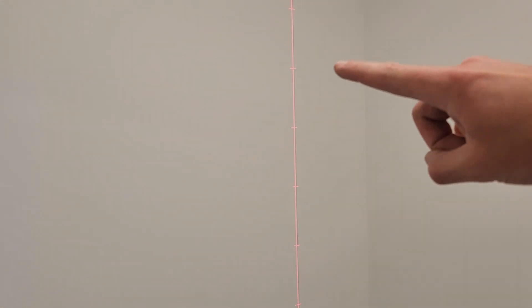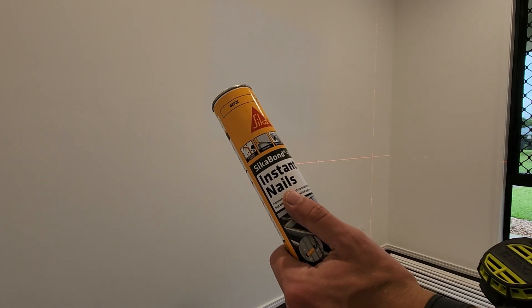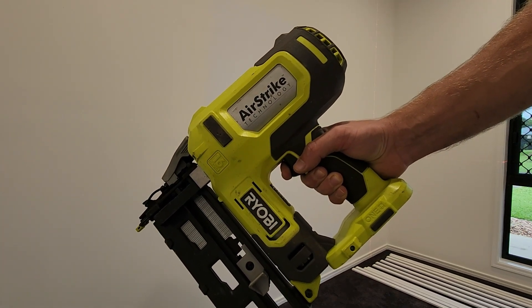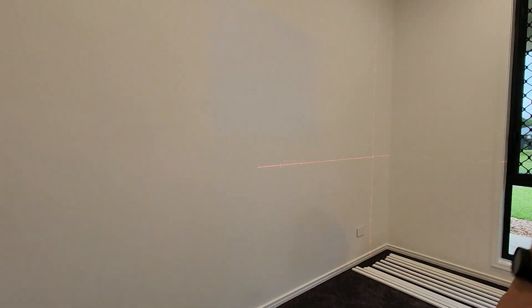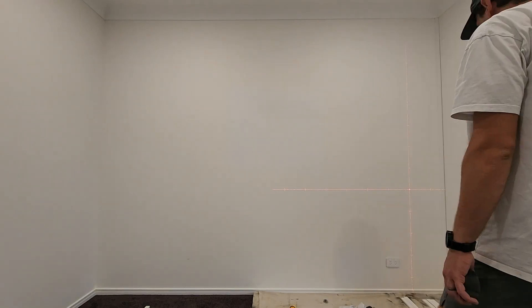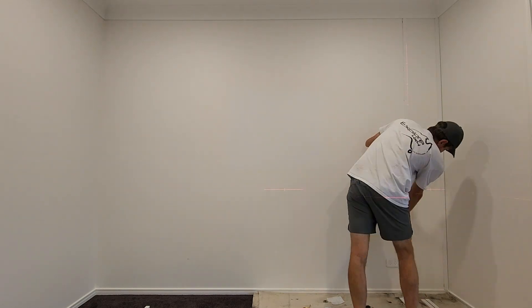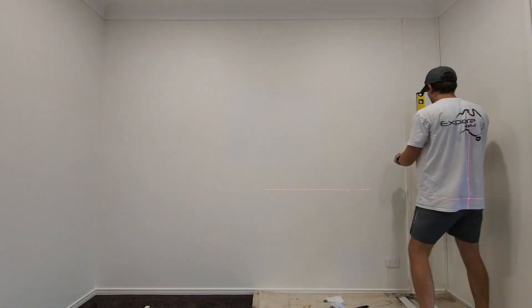This line is what I'm going to line the edge of each slat width to. To attach them I'm using some instant nails — or liquid nails for some of you — and when needed a couple of brad nails just to tack it in as a bit of a mechanical fix. The liquid nails is really going to do the majority of the job. I'm putting a nice thick bead of liquid nails down the whole piece, making sure one side lines up with the laser, and then a couple of tacks.